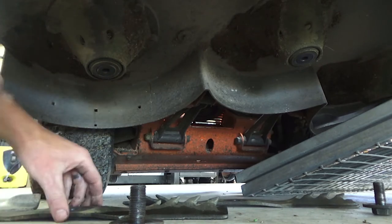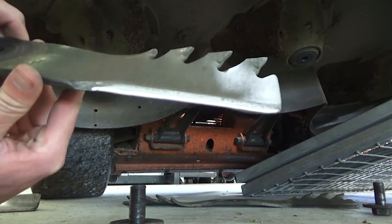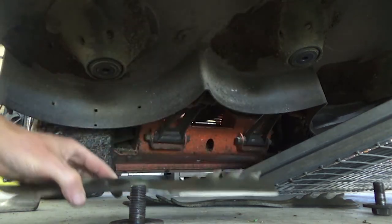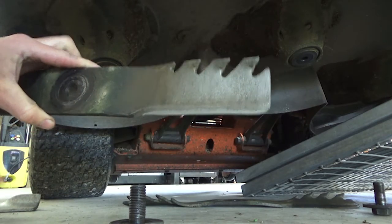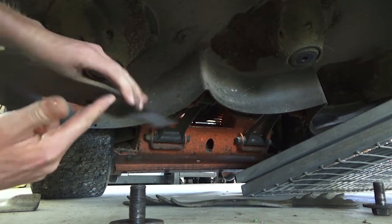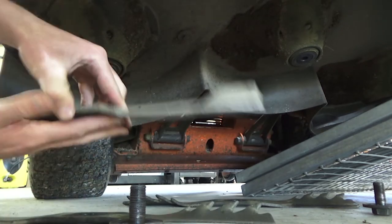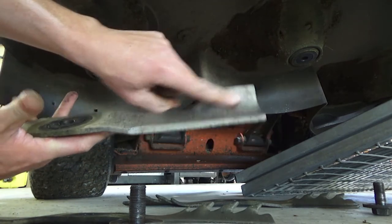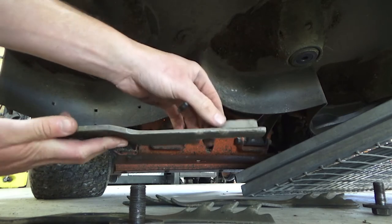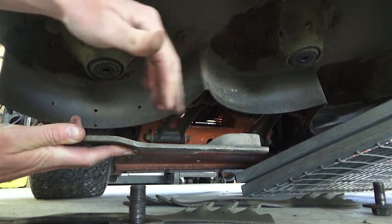Alrighty, here's the new ones. Okay, again, not the greatest, but also a lot better, and that's a lot sharper. They're also gator blades, mulching blades, whatever else you want to call it. These ones I find do blend it up that little bit better, even when you're side discharging. These ones simply clear the deck out quick, got little wings on them, and just really get a bit more airflow. Obviously you get that lift just there. Really sucks up the grass blades before it gets cut.